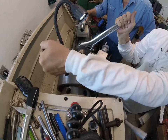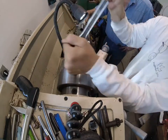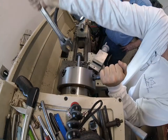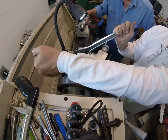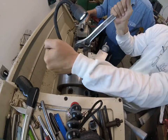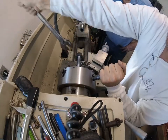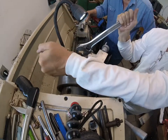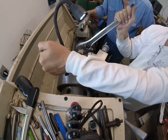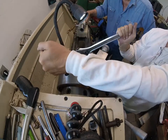So we are threading the end of an axle. We've got this on the lathe but we're cutting this by hand. This is our die, which we're turning with a wrench, turning the spindle by hand. We're going to come in four and three quarters inches and we've probably done an inch and a half so far.